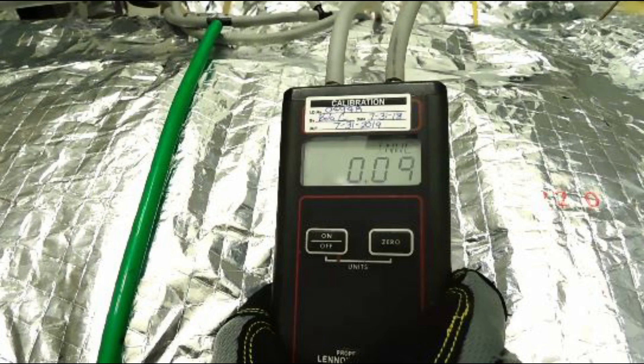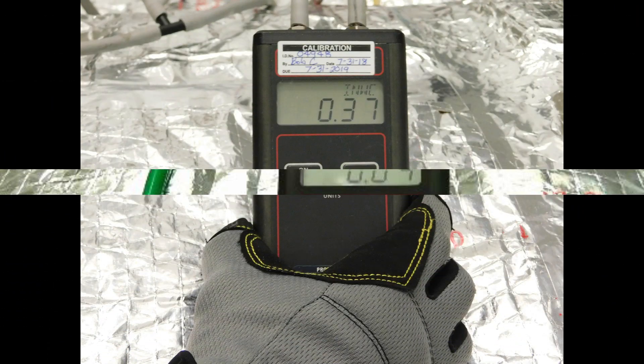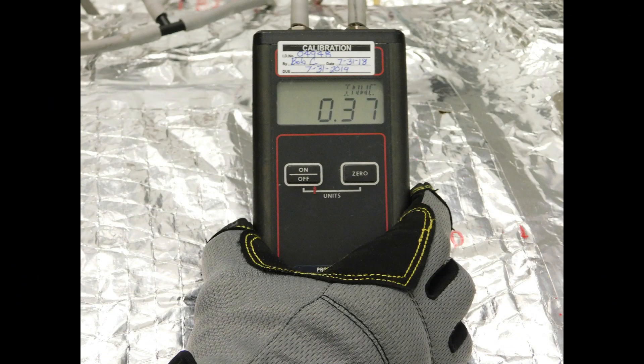After taking a measurement, place the 3/8 inch plug or other code approved patch to cover up the hole. Next, move the hose onto the manometer and the high pressure port on the gauge. Place the static pressure probe into the hole leading out of the unit and measure the high pressure reading on the manometer.